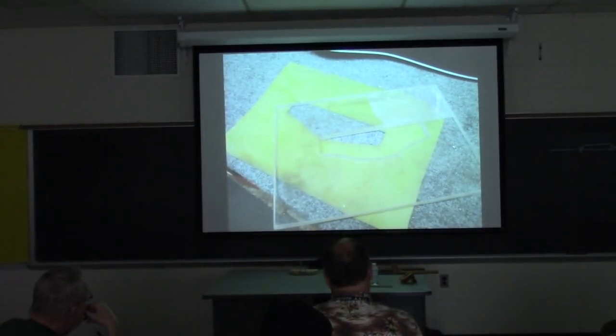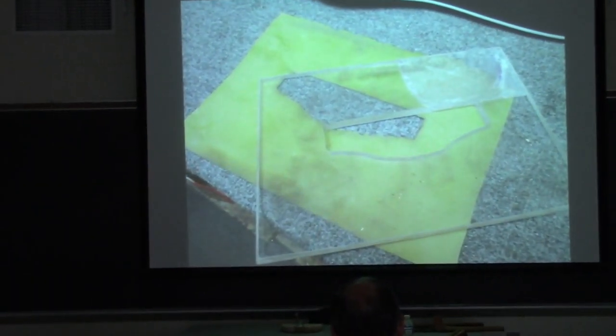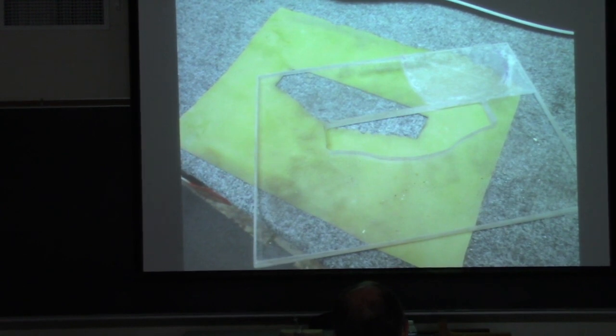Okay, so this is a jig that I made because, as we were talking a little while ago about the Collings guitars, where those are glued with a 400-degree release, I have to route them off. So I made this jig, which works just great for the Martins as well. It's just this little rubber pad here, and then a big hunk of 1/2-inch plexiglass. I did some quick routing one morning because there was a pick guard that was in my way, and I wanted this to sit flush and not contact that and cause it to kick.